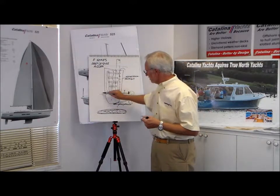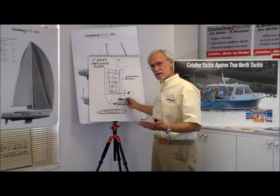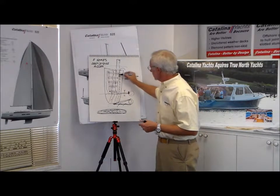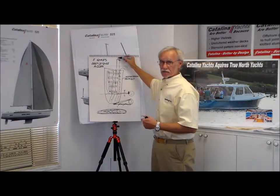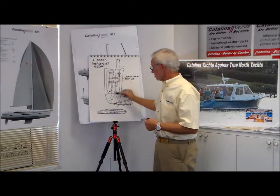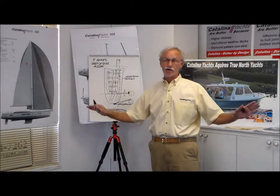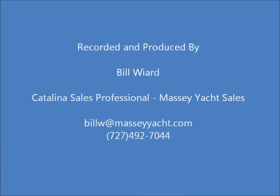These rudders are designed so the weldment only goes down about 60–66% of the depth. The bottom of the rudder is fairly light, with the intent that it would be a breakaway piece. You could actually break away that part of the rudder and still have enough to steer the boat — really a couple of different levels of safety. That, coupled with a very heavy stainless steel post — all these posts are double-walled, at least 10 inches up into the hull, and on many boats that double wall goes all the way up to the deck. These posts are very difficult to bend. If you break the skin away, you're still going to have something attached. We've tried to build a number of different levels of safety into rudders, because the rudder is probably the last thing you want to lose on a boat — if you lose the rudder, you have no control.